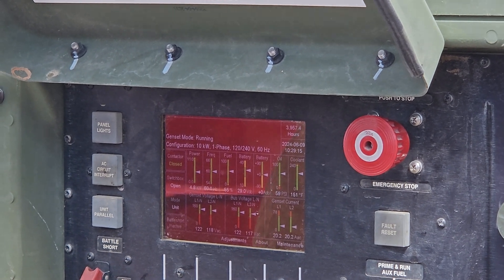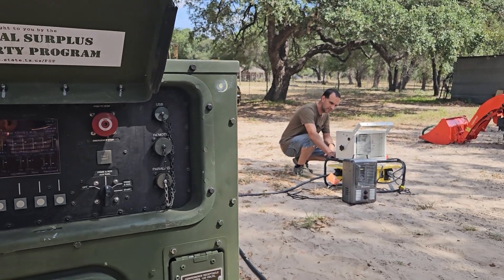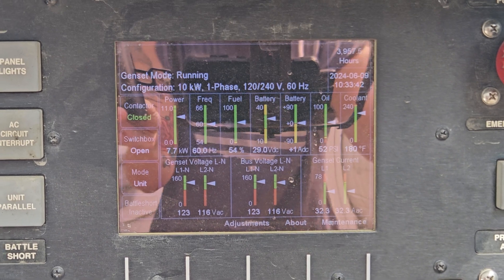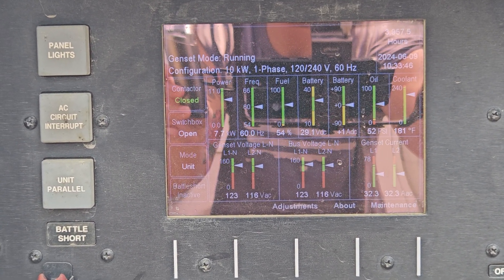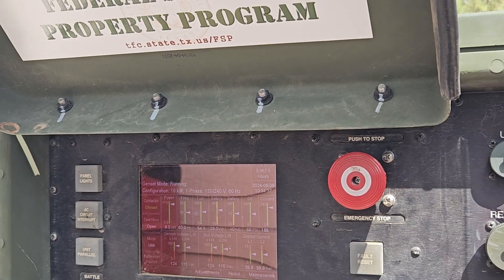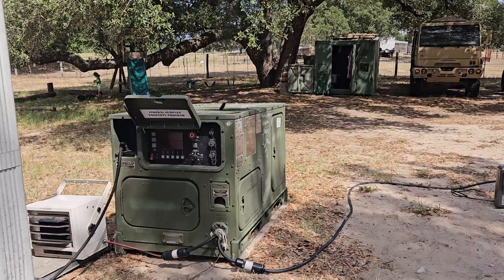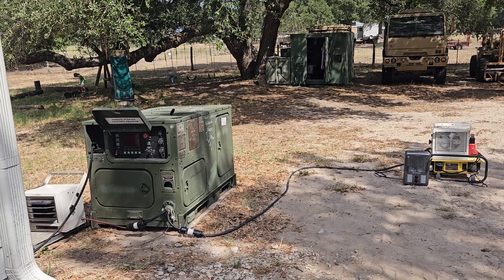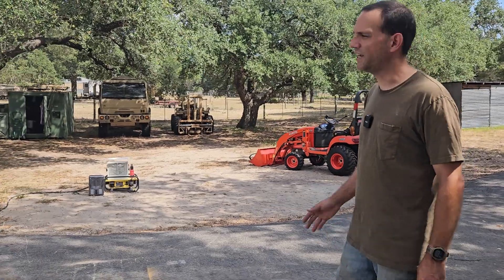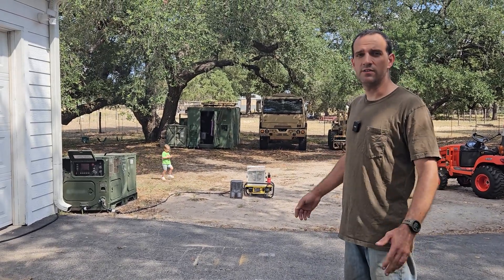Come back when we go up to the next jump — it's been five minutes. Going straight to 5,000 on this one. Same deal where it takes a little bit for the heater to actually ramp up. She's rolling some coal now — not a whole lot, but that's what we want. It's pushing out some soot and that's what we want because it probably hasn't run this hard in a while. In three more minutes we'll spool it up higher. I'm curious to see how much over rated capacity it'll allow before it trips out.